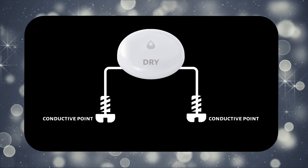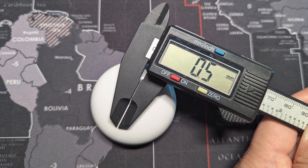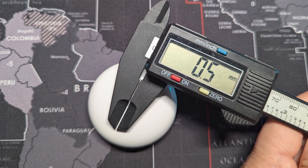So how does it work? The sensor has two metal screws on its base. When water connects these screws, it completes an electrical circuit, signaling to the sensor that water is detected. That means you can place it flat on the ground where you're worried water might pool, like underneath a sink or dishwasher. It takes just half a millimeter to detect the water. In most cases you'll be placing it flat, but you can also extend the metal screws and connect wires for more versatility.